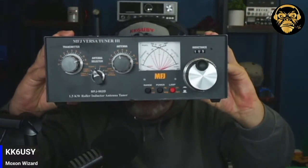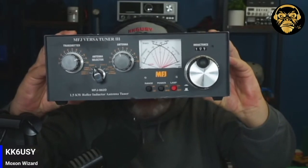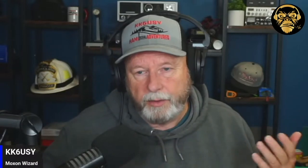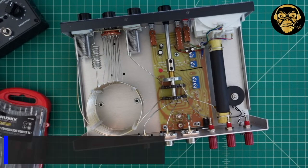And that's a much nicer tuner. What is that tuner, Chuck? It's a 962D. That looks very pretty. It says 1.5 kilowatts. Never trust what MFJ says on that. This was actually made for their four-tube — the 811. It's made for that. It'll handle about 800 watts. And I bought it because I think it was the smallest one I could go with for portable, since I have about a 500-watt amp that I can take.